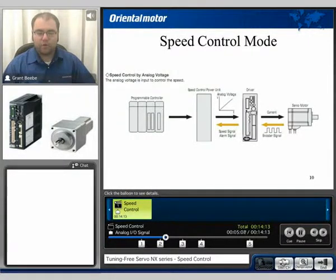For speed control mode, your control system block diagram may look something as shown. From your programmable controller, you can send information to a speed or power unit, where you can send an analog signal. The analog signal is then fed to the drive, and then the drive interprets that signal and generates motion in the motor. The encoder feedback will go back into the drive, and then you can send either a pulse feedback or an analog signal feedback back to your main controller.